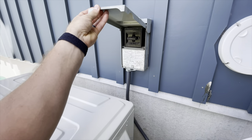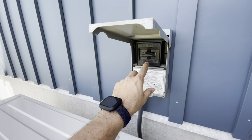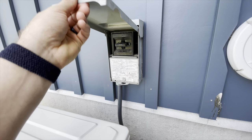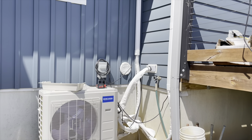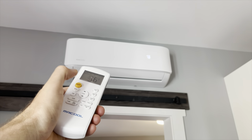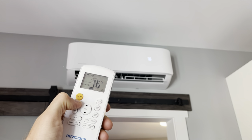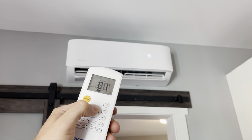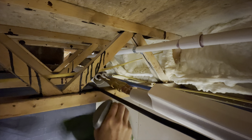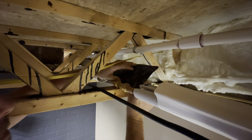This is just your basic HVAC standard disconnect. This is actually kind of an old one my dad had — a fused one, whereas a lot of the newer ones don't actually have fuses in them; it's just a disconnect. But it's working fine. Once everything is hooked up including the power and all the valves are open, all I had to do was switch on the breaker. The instructions tell you to turn on the indoor air handler units to the highest temperature and then the coldest temperature and run them for five minutes each to make sure there are no leaks. So I did each indoor unit individually, and while that test was running, I went around to spray the different connections and make sure there were no leaks. Once I was good on the leaks, I could start installing the sound deadening tape around all of those connections.